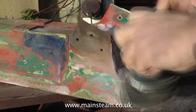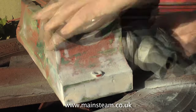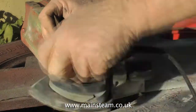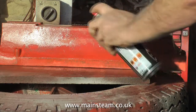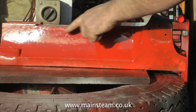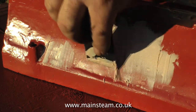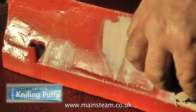Back now to the boring bit of sanding down the base casting. This base casting was very rough indeed and the paint was bad too, but I daren't remove the paint fully because I would then have to skin the entire casting. Some of the paint's pretty good and some of it's very bad. Now I've got rid of the bad paint and filled the depressions — it's just a process of eliminating all the depressions. I'm looking to get a good smooth finish and I'll be painting it with a paintbrush, so it will look like something from the time period of the industrial revolution. It's sprayed with primer so you can see where the depressions are and fill them again. Don't use too much filler though — if you put it on too thick it takes too long to rub it down. I'm also now working with cellulose putty or cellulose stopper, which is finer than car body filler, and eventually you will get rid of all the depressions and get a very smooth casting ready to take the main coat.